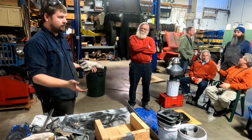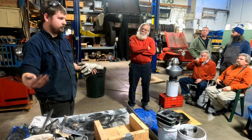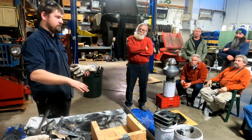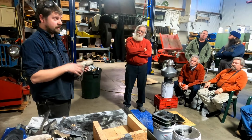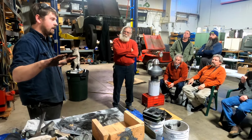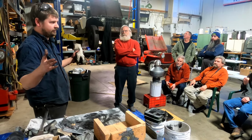When I run my main melt, I always add virgin brand new ingot back in with my returns, so I never melt pure returns. So for today, all of this was ingot last week, so it's all brand new metal. It's one-time burn metal, so I know I didn't alloy enough of it off.